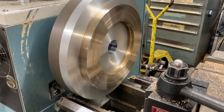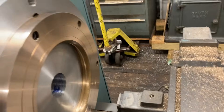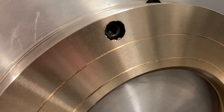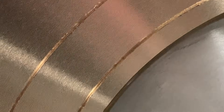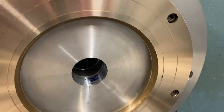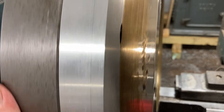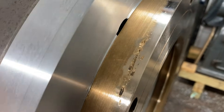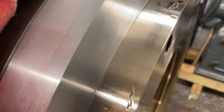All right, so that's it. I go over to the milling machine afterwards and I counter-sink these holes — clean up all those holes right there. But it's a substantial improvement to what it was. I'll go back and deburr these things. Sometimes I'll rerun the trepanning tool just to clean it up. That's about it — that's what we got. So it's a substantial improvement, that should work. So now I have to go back and clean these oil feed holes. Look at the OD of this thing — what would cause somebody to beat the living hell out of this thing in that nature?